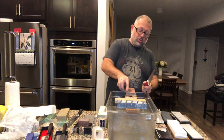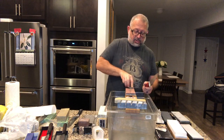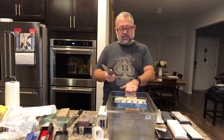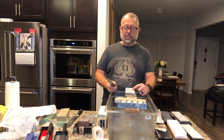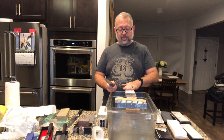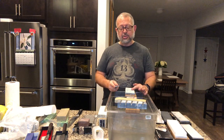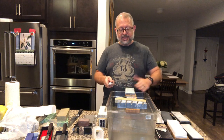So what are we gonna do? Are we gonna go to the 5,000 or the 6? I have a 5,000, I have a 6, I have an 8. So let's just jump to the 6. I just flipped the stone over and there's slurry on it, which means the slurry came from the 3,000. Do not let 3,000 grit slurry be on your 6,000 side, because then the particles are still doing the 3. You don't want it to interfere. So we get it nice and clean.